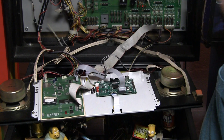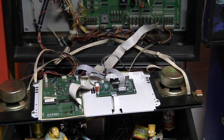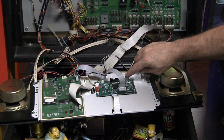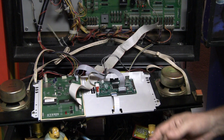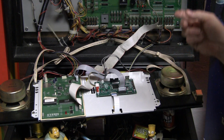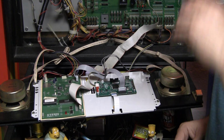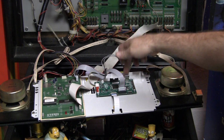And then once you've got it installed, you can turn it on and it'll actually work, but it works in black and white. So before it's color, you have to flash this controller board here, and you'll see there's a USB receptacle there. So what you do is you'll download the software or the ROM, flash ROM, from the website, which is colordmd.com/support.html, and then you copy that into the root folder of a USB stick, stick the USB stick in there,